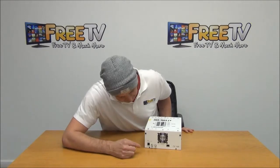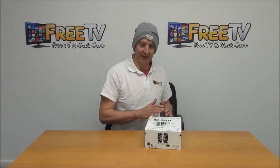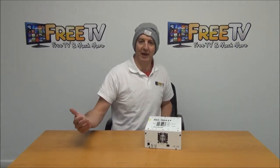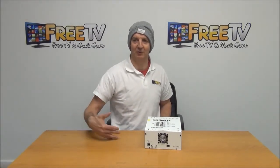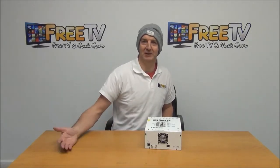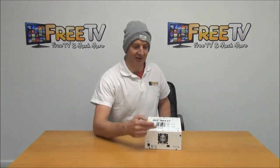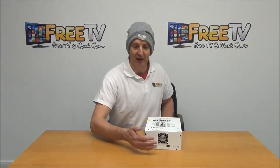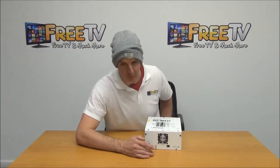All from HDMI inputs. Coming along here, we have our RF output — this is the DVB-T and cable output here. We can feed this into our existing distribution system, so up to eight channels can be fed directly from this. And if we take a Saorview or a Freeview aerial and run in our channels — in the case of Saorview here in Ireland, that'd be about eight channels; in Freeview in the UK, it'd be maybe 20, 30, or 40 channels — you can feed this directly in, combine it with the DVB-T signals from the satellite connections via HDMI, and feed it all out as a single head end being distributed from it.